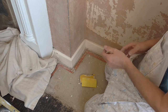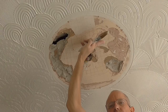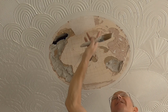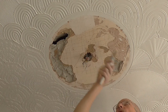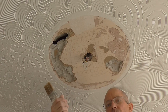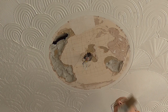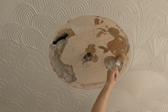That's ready for some polyfiller there now - there's some areas that you may have to put some foam in first. People ask when do you PVA and when do you not PVA. Now sometimes the surface is just too dusty, like this backing plaster here - so I'm going to actually put some diluted PVA all over this. Other occasions if it's not that dusty and you're just filling a hole on a flat wall, then you're okay just to go over with the polyfiller. Polyfiller sticks to stuff really well, but with this I'm just going to give it a coat of diluted PVA because this is really rough and dusty.